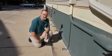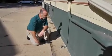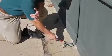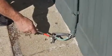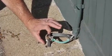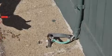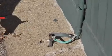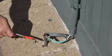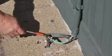Here's the second most popular electrical ground found throughout the United States. It's called a driven ground rod. Now this driven ground rod, as you can see, is about 2 inches above the surface of the concrete. Frankly, it's supposed to be left flush to the concrete, but the code official needs to examine that it's present, so electrical contractors leave it a couple inches above the ground to confirm its presence.